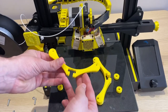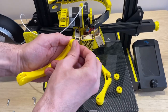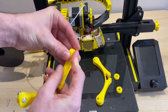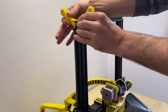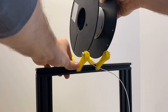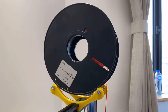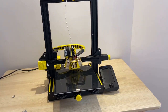Here are the brackets printed out — very simple: just two brackets and four wheels. The wheels slip into place, assembled with M5 bolts and two locked nuts so they can't fall off but the wheel can still freely spin. To install the brackets, just slide them onto the extrusion profile, assemble the second bracket, then pick your spool and set the spacing to match it. These brackets can also be easily adjusted for bigger or smaller spool sizes. Here's a shot of that spool holder rolling smoothly during a print. And finally we can get rid of the side bracket — we won't be needing that anymore.